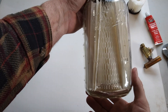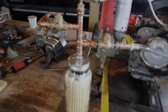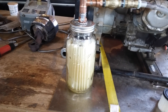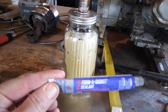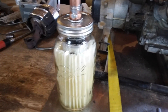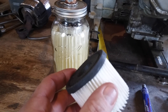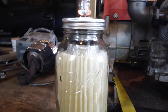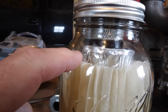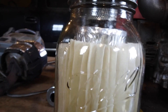That's what it looks like on the inside — the fuel will just be a little bit on the bottom. A few things to note if you're going to experiment with something like this: you need to use materials that are compatible with gasoline. For sealing, this 'form-a-gasket' product is compatible with gasoline — don't use silicone, as that'll slowly be eaten away and loosen up. On these filters, the rubber starts to swell a little with gasoline, and on one I actually had to cut some of it off. I put a wrap of aluminum tape around there to hold it together and ensure the air goes down to the center rather than escaping at the top.